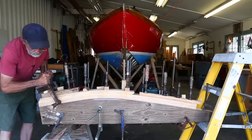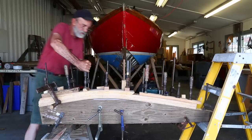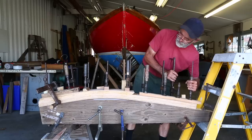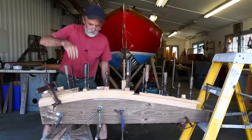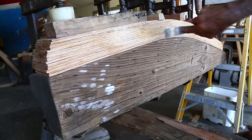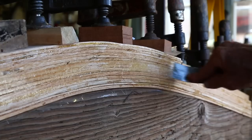We're putting on the last clamp vertically to hold the laminates together, squeezing them up against these vertical pieces of wood so they all line up nicely before I tighten down the clamps holding the laminates together. Now let me go along the top and check that these are all reasonably tight — you don't need them any tighter than that, you'd just squeeze all the glue right out. Now I'm going to go back around and take these clamps and vertical pieces of wood off so they don't get glued to the side of the thing.